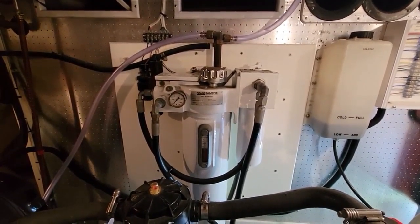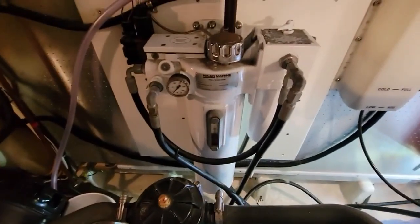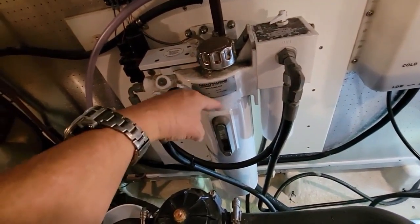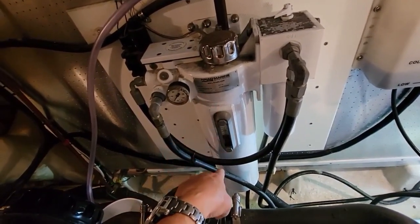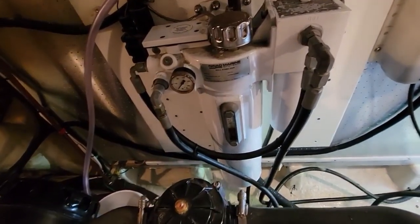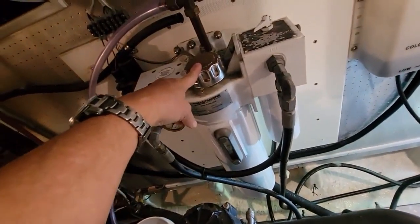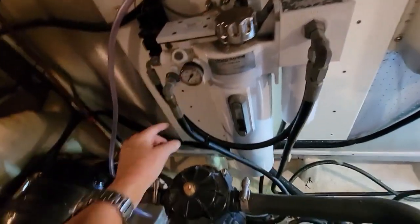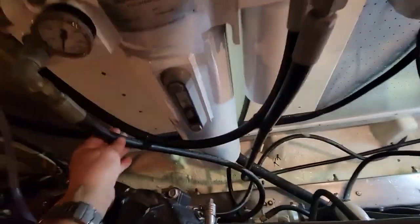Let's go through the system here first. This is the big system right here — this is the reservoir tank, also the heat exchanger. Copper coils go down into this tank, filled with super clean hydraulic fluid. Here's your pressure gauge. This is the breather cap, also the fill cap for the oil. These are the hydraulic lines here — you can always tell they're hydraulic lines by their super dutiness; they'll say 3,000 psi on them.